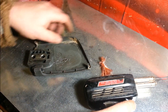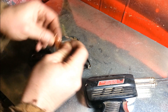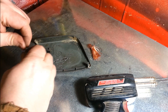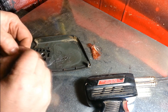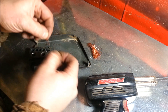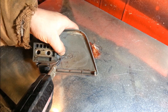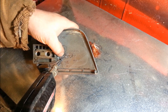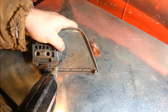The next step is what I'm going to use here. You can use steel wire — this just happens to be some copper wire that I cut off of a battery cable that had some extra and I just set it aside for stuff like this. It's a little long, so cut it down just a little bit. Double it over. What you do is lay that across the crack, put the soldering iron right on top of it, and because the wire absorbs heat really well, it'll just push right in and you can push it down pretty far.